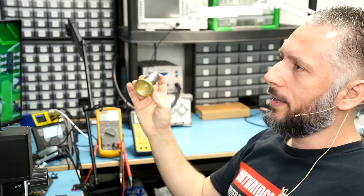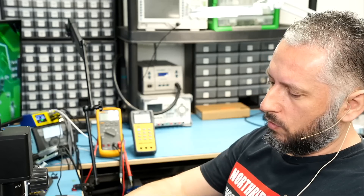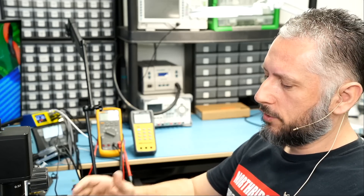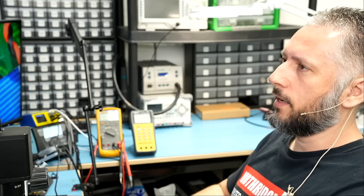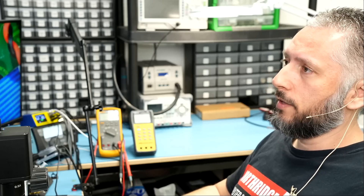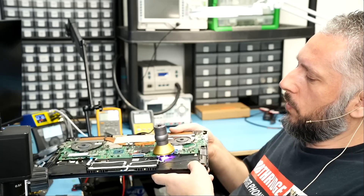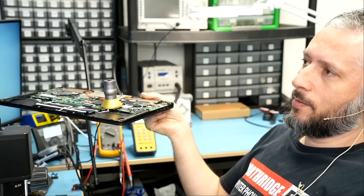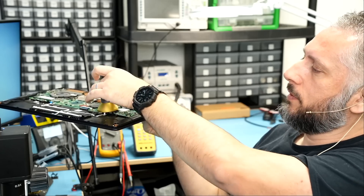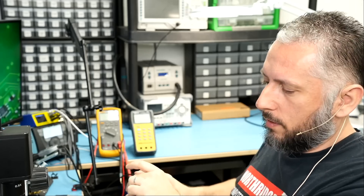We're going to use our NF UV lamp — that's a 10-watt equivalent lamp — and place it over the solder mask. The lamp is going to shut off by itself in maybe 20 to 30 seconds. We can press the button again to go another 20 to 30 seconds, but I think 20 seconds for this one is enough. What I love about this lamp: the cup does not allow light to spill, so the light is focused on the UV mask. The lamp shut off by itself.